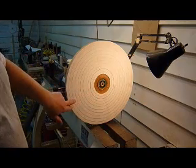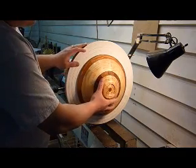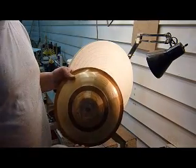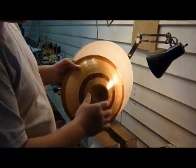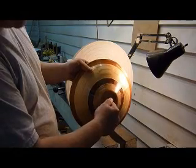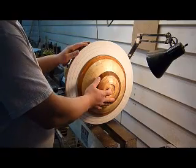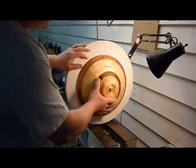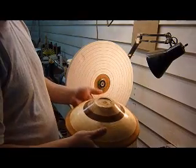You will note some circles here — that's just to help you line up the piece. Now, if you were turning a ball from scratch and you knew in the end you were going to vacuum chuck it to clean up the bottom, you would want to, in the turning process, leave a dimple or something right here. That way you can use your tailstock to center it, slide your tailstock forward, and that will center the piece on your vacuum chuck. But the circles never hurt, especially if you ever want to go back and do a piece that you've already finished, like this one.